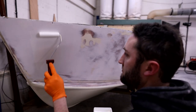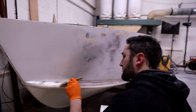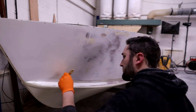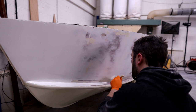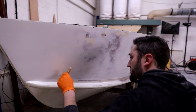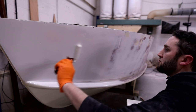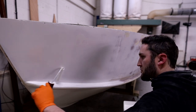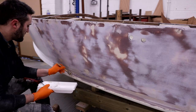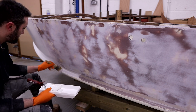Then we're on to the primer. I'm using the Epiphanes high-build epoxy primer again, the same one used on the bottom, and putting it around the topsides of the boat. I used a brush for the little spray rail areas and then the Anza roller — a couple of people asked about the roller used on the top coat for the bottom. It's a product made by Anza, a little felt flock roller, and it's really nice — doesn't have any hair or bristle loss which some other flock rollers do.